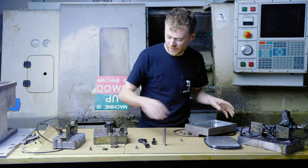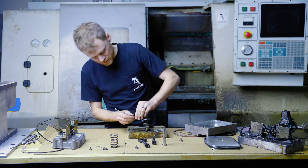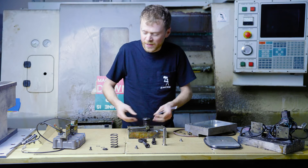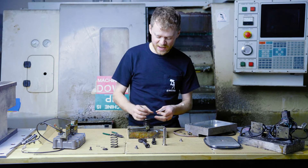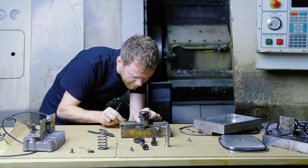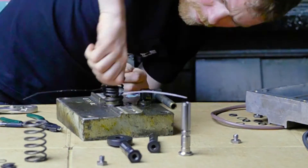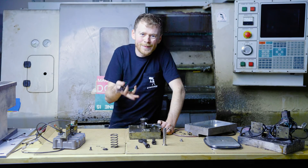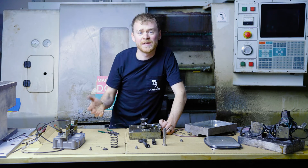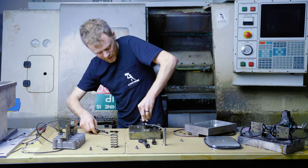Let's talk about taking it apart. If it's working and you want to fix it, you need to depress the spring. The way I found works is to use wire ties — put three or four wire ties all the way around it, tighten them up, and that will depress the spring enough to use snap ring pliers, pop the snap ring off, and pull it out. There's probably an easier way to do this in a drill press, but I usually work in the field with limited tools. This is a simple way to just depress the spring. I've got it depressed enough.